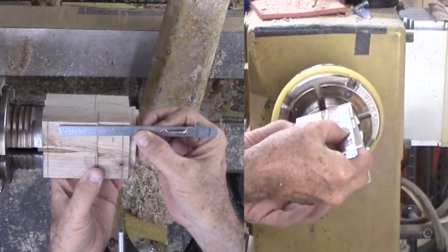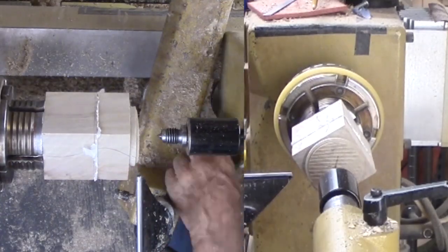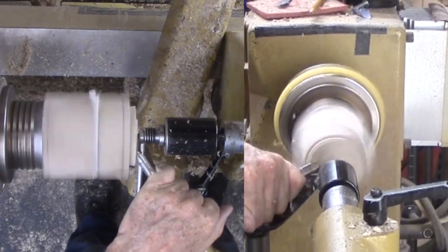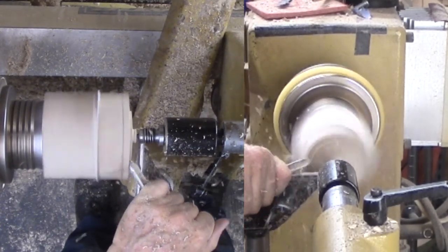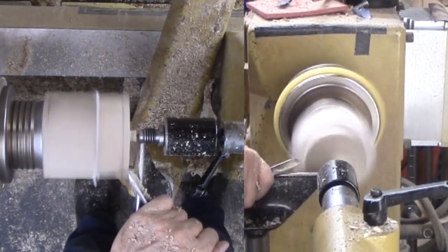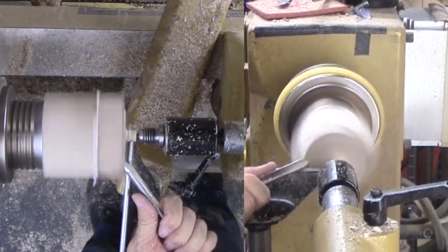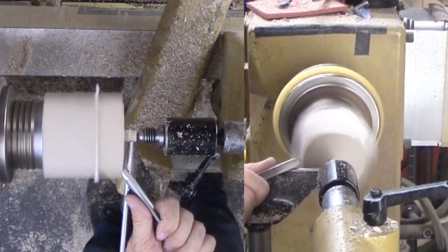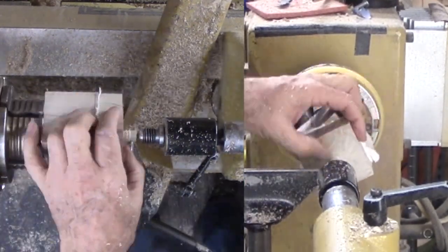I take a moment to mark the exterior top of the lid portion, allowing about a quarter inch beyond the hollow. I mark all four sides to be able to see the joint well while the wood is rotating, then insert a paper towel in the joint to tighten it. With the live center in place, I can reduce this end to the target mark. I use the spindle gouge for the heavy cuts leaving a small nub, then with light cuts remove the nub and fine tune the surface that will be the top.